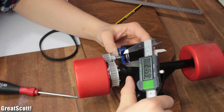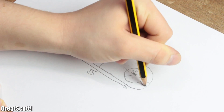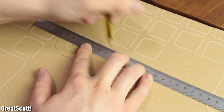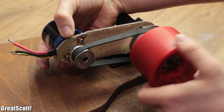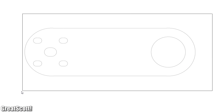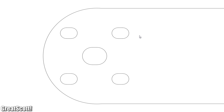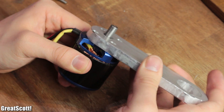So obviously, I started with that by creating a couple of crude technical drawings, which I used to construct a cardboard prototype that worked surprisingly well, even during the first try. I then created an optimized vector graphic with Inkscape, that features elongated mounting holes for the motor, in order to adjust the tension of the belt.